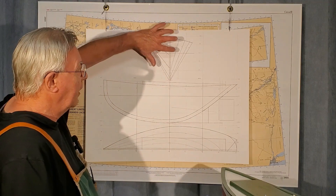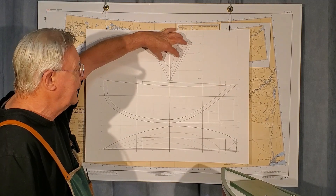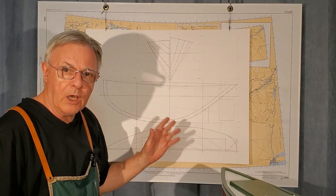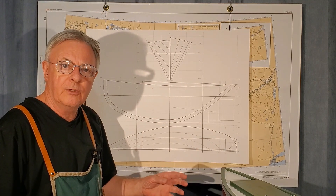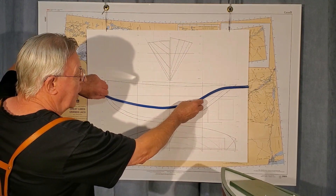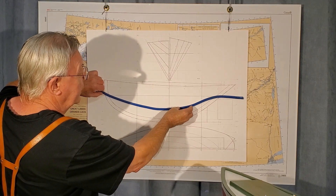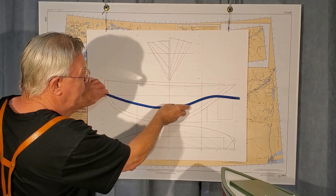That's a lot of rudder and a lot of power for this size hull. Even though this hull has a fairly deep draft, it is a very easily driven form, and the power I had available was way too much for this small model. In fact, I don't think I used more than half of the available RPMs during that water test. The shape of the hull will push a lot of water astern when pushed beyond hull speed, and a lot of what you see in the video is the hull being pushed a little harder than it should be, but it did get me some interesting results.